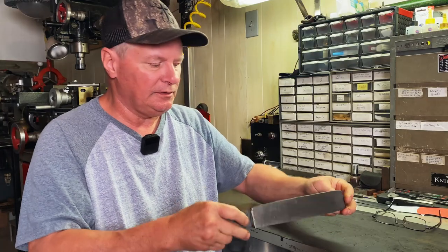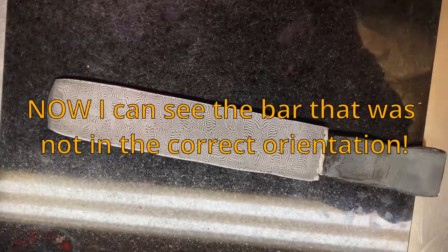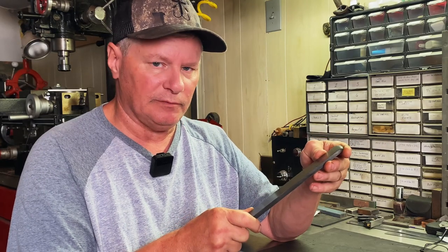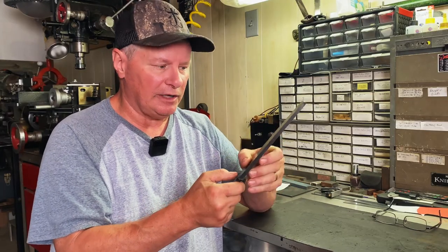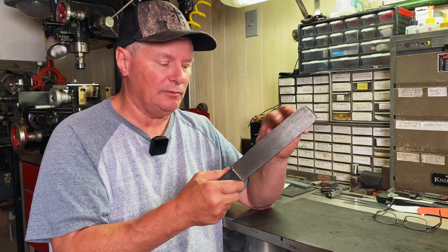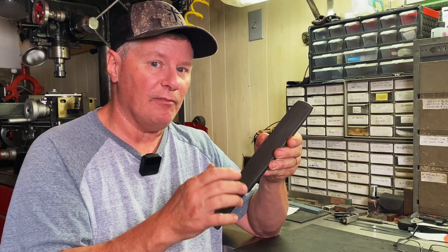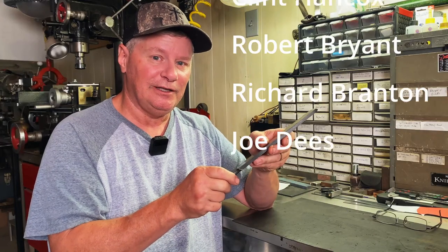Let's take a look at what we got here — I'll put a close-up shot here. Now I got one of my tiles flipped the wrong way, but this billet could use some more drawing out to equalize the pattern a little bit and make it more symmetrical. It's got a good bit of distortion, but drawing it out would help — we'll call it retro basket weave. A lot of that is just not good control on my part. I still have a good bit of thickness to draw it out some more and I want to stop, take a look at the pattern, and make adjustments from there. I hope you got something out of it — if you'd like to see me make the knife out of this, watch for the next video, part two. I want to thank you for watching, I want to thank my patrons, and we'll see you on the next one.